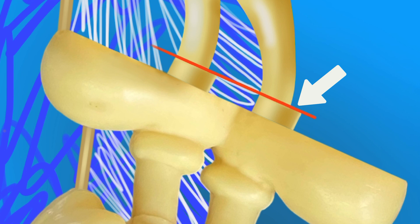If you look closely, you'll see that the sprue is not the same size as the pin, because doing it this way tells me exactly where to cut the sprues off. I don't have to guess the length — that little area tells me exactly how long the pin should be.